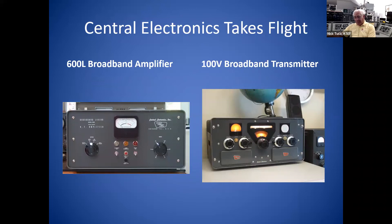The picture on the left is the 600L. It had a meter switch on the left, band switch on the right, meter in the middle, and status indicators under the meter. The left indicator is just the filament-on light. The right red one indicates high voltage — the set is ready to transmit. The middle one is an alarm or fault indication: if you had excessively high SWR or were overdriving the amplifier, that light would come on and the amplifier would trip itself out to protect itself. You literally couldn't damage a 600L.